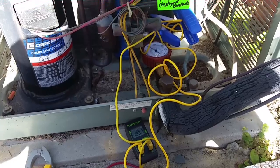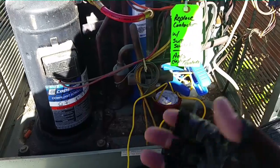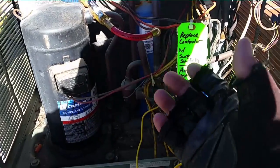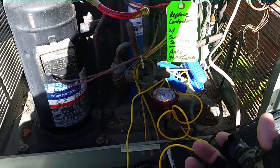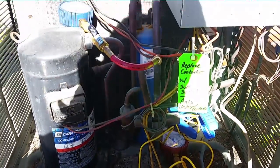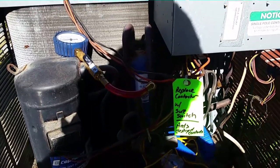As you can see, the discharge superheat coming off the line must be cooled to become condensed liquid refrigerant. The higher the discharge temperature, the higher the superheat, and the less refrigerant in the coil — the less likely it is to condense under pressure with air blowing across it from the outdoor fan. They all kind of go together.